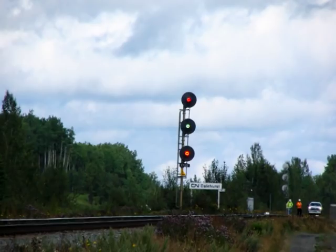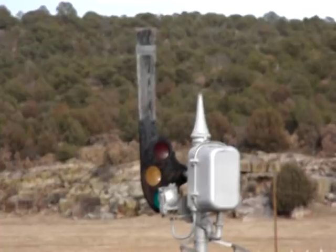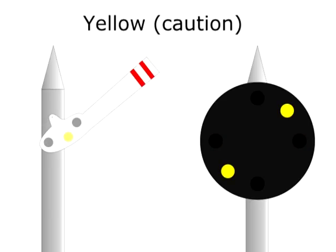The signals I'm going to show are Canadian railway signals. A lot of railways in the US use these same signals, or similar, or the same concept of signals, but with different methods of display. We use coloured lights here in Canada, but the Raton subdivision in New Mexico still has semaphores. The Pennsylvania Railroad and Baltimore and Ohio Railroad use a cross between coloured signals and semaphores — the lights are coloured and show the semaphore position of horizontal, 45 degrees, or vertical.